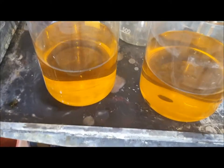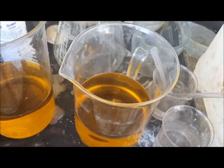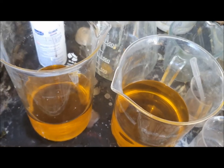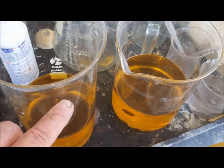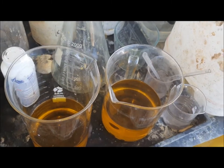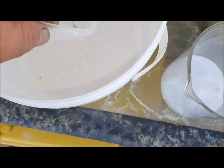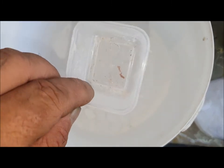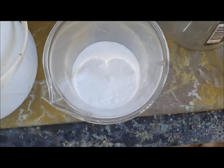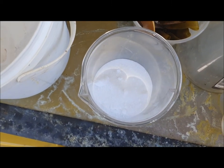If I've got all the gold, that aqua regia won't go to waste because I've just started doing some normal BGAs and I can save the aqua regia for that. I just want to make sure I've got every single bit of gold. So now I'll put a new filter in here, pour everything into one nice solution — look at how good that looks. Beautiful, almost ready to drop the gold. Both have been filtered, lovely and clear. The reason it's in two containers is I've got room to put the SMB in because it can sometimes overflow.